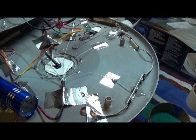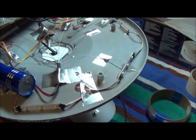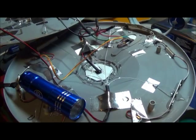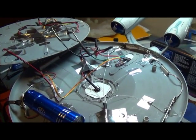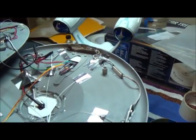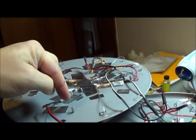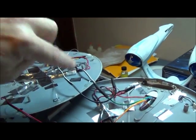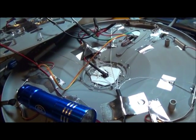Now, the first thing I'm going to do is fold this over and not line it up with the pins, but press it down just to make sure that everything will lay flat. That'll tell me if there's any binding issues between the fibers and the wiring, and will let me know the best way to tape anything down to make that easy. Then I'll pick it up, spin it a little bit, and push it down on the pins. I think I'm going to maybe take an X-Acto or some other device and maybe just knock the flat top off of these pins, maybe make them rounded a little bit. That'll make them self-centering and easier to go down into the holes.